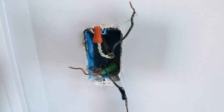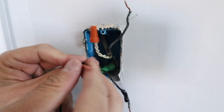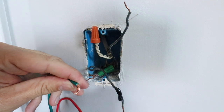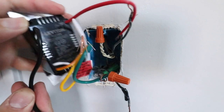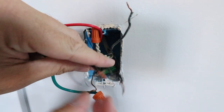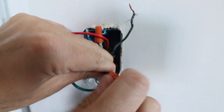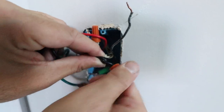This is not a three-way light switch. A three-way light switch is where two switches control one set of light fixtures — you typically find that at the top and bottom of a stairwell. So let's get started installing. I'm going to take my green ground wire and connect it to my unshielded copper ground wire. Just wrap those two together, then take a wire nut and screw them in place. Now we've got our line wire — we're going to connect that to the incoming hot wire marked with a piece of electrical tape, and screw those two together. Make sure you get the wire nuts on there nice and firm so the wires won't pull out.